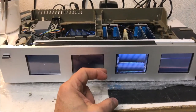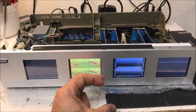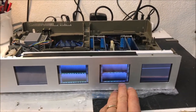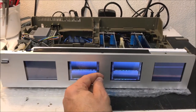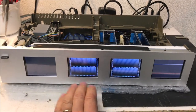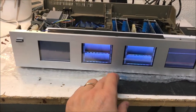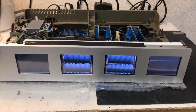So I usually use here now this oscilloscope. Then I use here more the base frequencies, and here more the higher frequencies. You have here the full spectrograph, and then you see the low frequencies. And so this is just usually the setting that I use. So this is the low frequencies from 0 to 2.3 kilohertz, and then from 3 kilohertz up to 20 kilohertz.